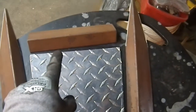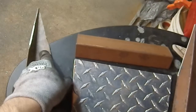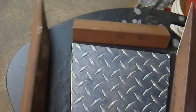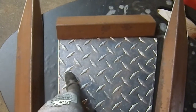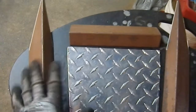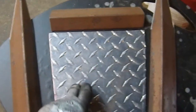But that is not going to be able to receive a final fit until these have been installed, because I am going to notch out these corners so this will be right next to this. It won't come in contact with it, but be right next to this, so there will be no gap. And this section here will have to be cut at a slight angle to match the angle of this when it's finished. So that cannot be fitted until the end, when I can cut the notch and I can cut out the angle and everything so that it fits this well.